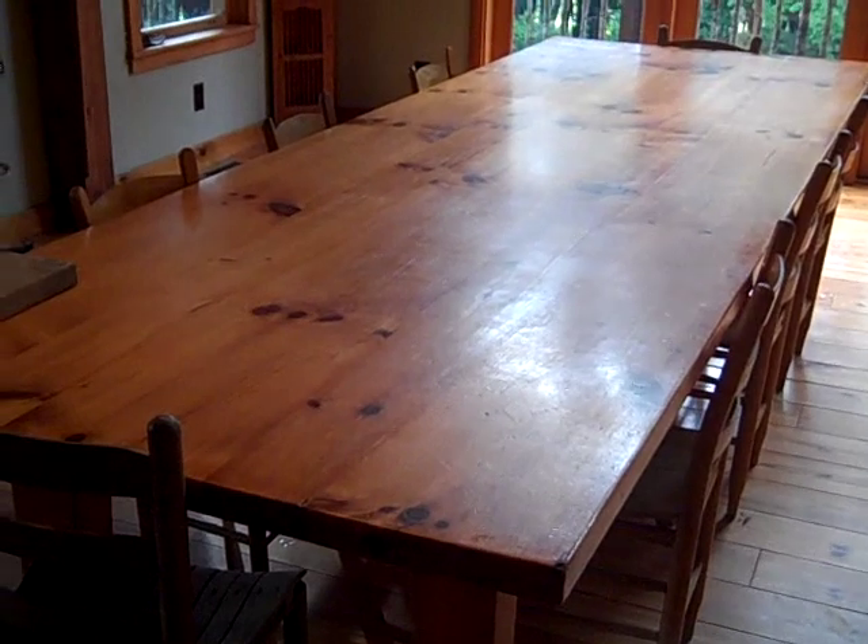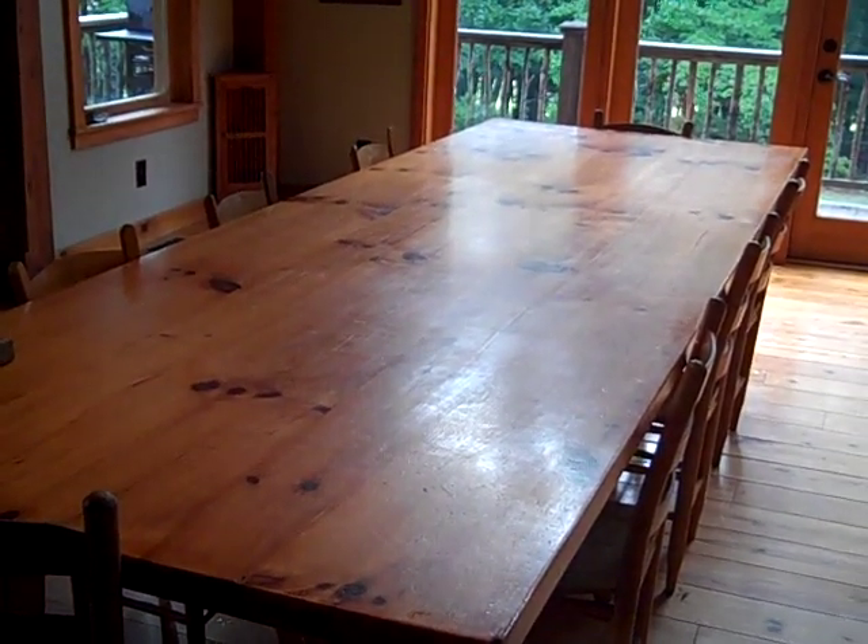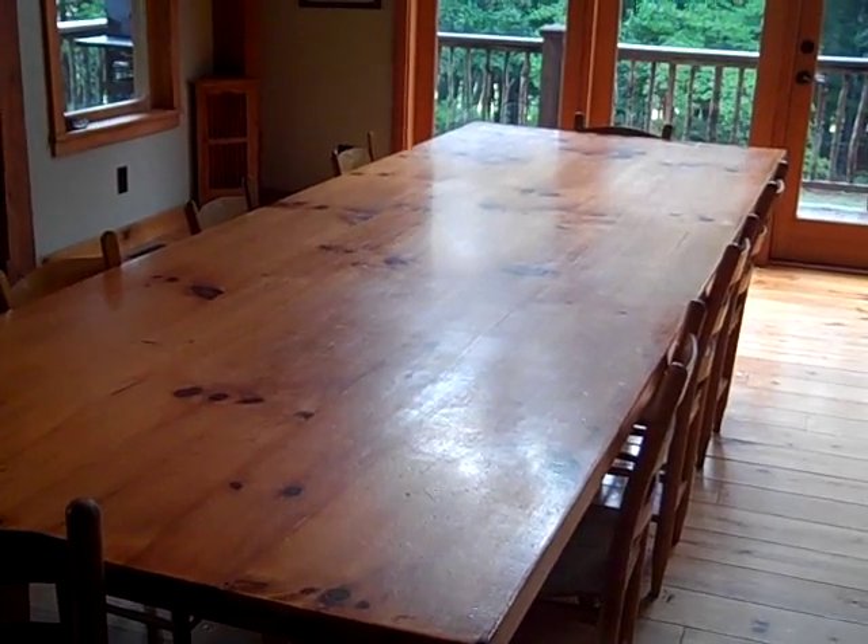I got those boards and put them up in my barn for about 2 years to let them completely dry. It's really a good drying area up in the barn. I had enough lumber to do the top and the legs, and I did 2x6 rails to hold the table up. My original plan on the 16-footer was to put a 5th leg in the center to prevent sag, but after 4 or 5 years now, this table is nice and straight. I did crown those 2x6s.